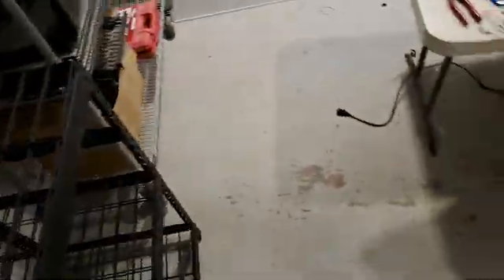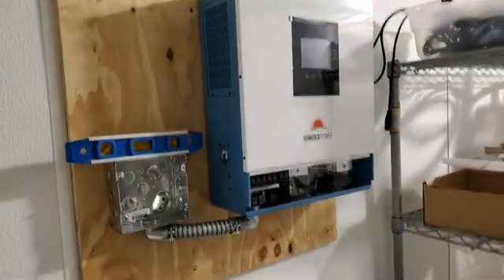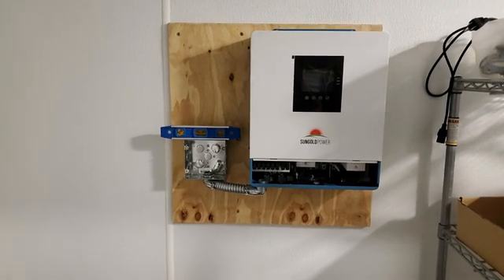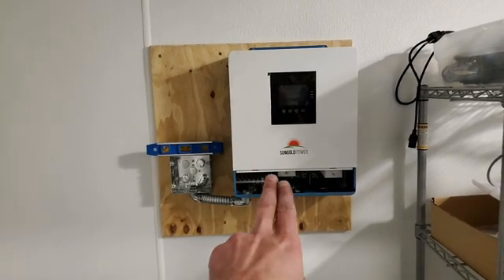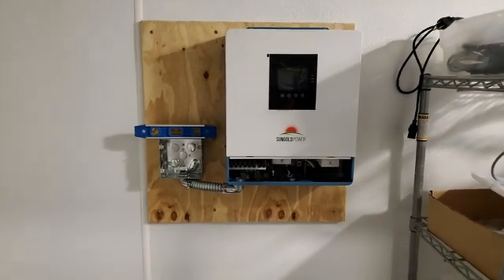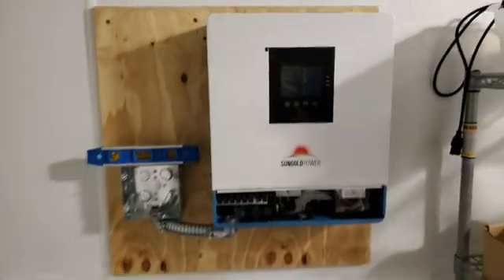Our new POP is going to be about double the size of this room and about 35 miles away. There we're going to try to go really crazy on the solar panels — maybe get the full 60 amps worth of solar plugged into this. This unit has a 60-amp MPPT controller, so it can take 60 amps of solar. It also has a 40-amp charger for the battery, so if line power is hooked to it, it can only charge the batteries at 40 amps. But if solar is also hooked to it, the maximum combined charge is 100 amps. Pretty stoked on this.